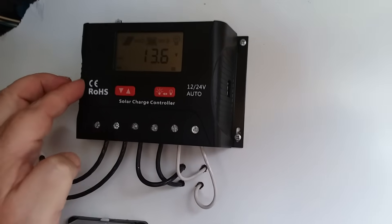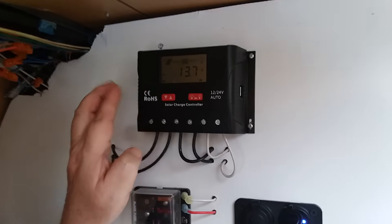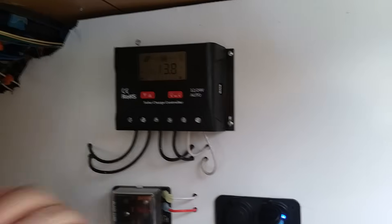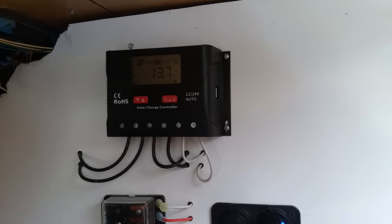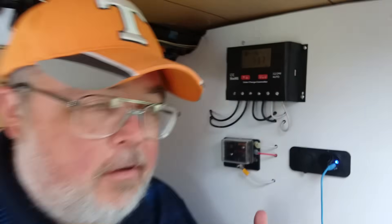It has the CE mark — the European equivalent of Underwriters Laboratory — so it means it's not going to burst into flames. It came with the kit and we'll link that down below. The MPPT type is really better if you've got a bigger system, but for our 100 watt system right now, this PWM is doing fine. It takes the power coming in from the solar panels through our ceiling.